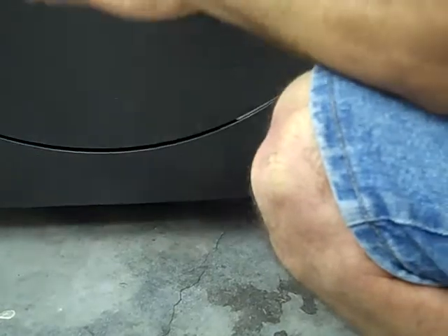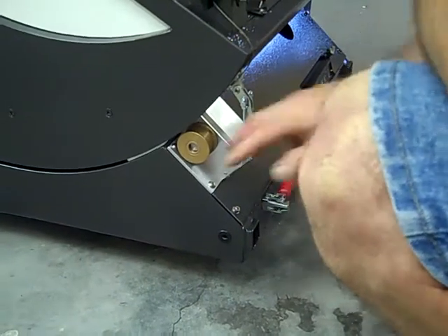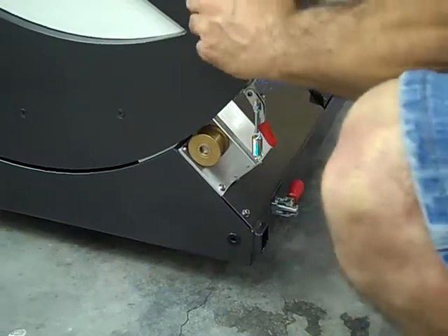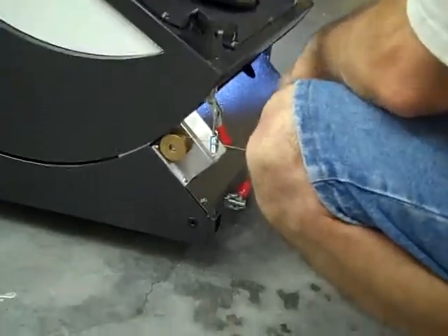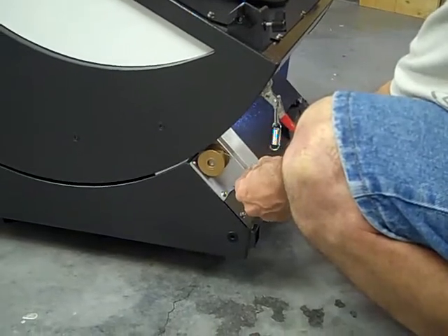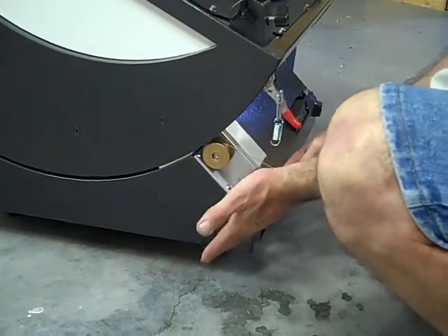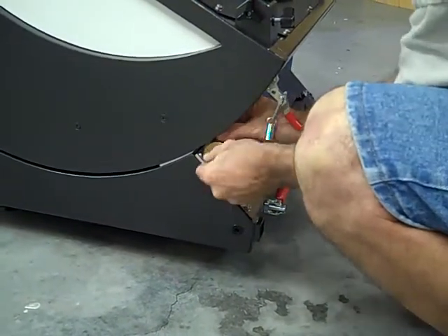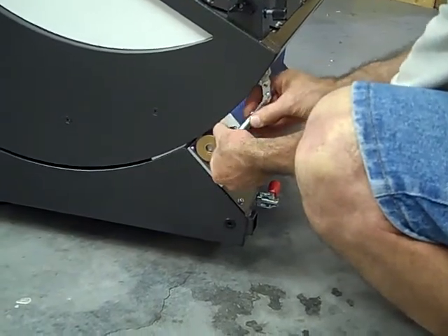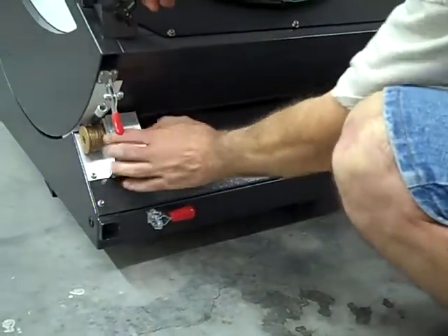With the mirror box in place and the cable lined up in the grooves, the next thing I'm going to do is put the cable onto the drive roller of the altitude motor. This has to go two clockwise turns around the pulley. Just one turn, pulling it tight, then two turns, pulling it tight. I'm going to bring the disengaged lever all the way back and put it into the spring. Make sure that you do not overlap the windings of the cable on the pulley.